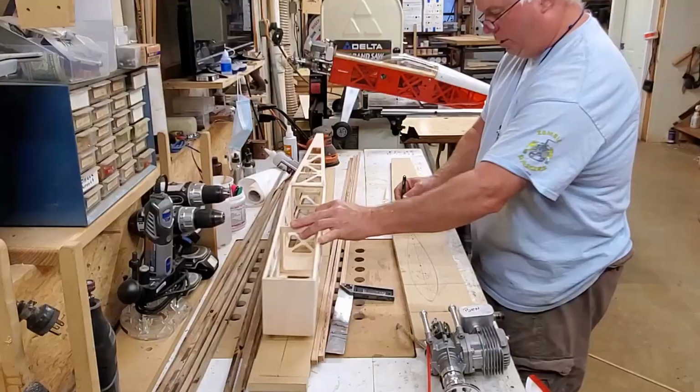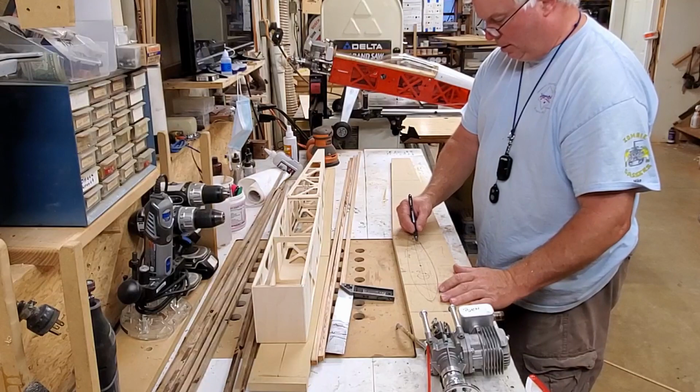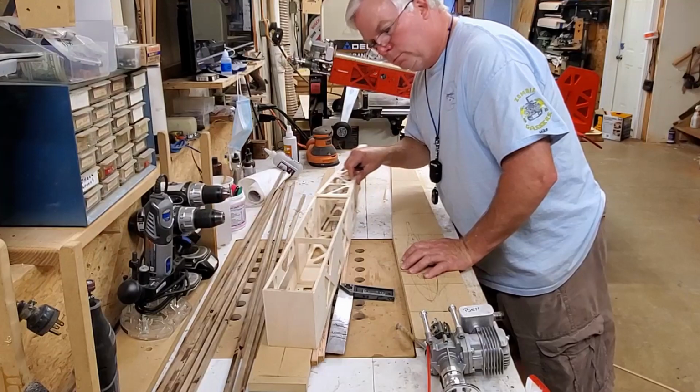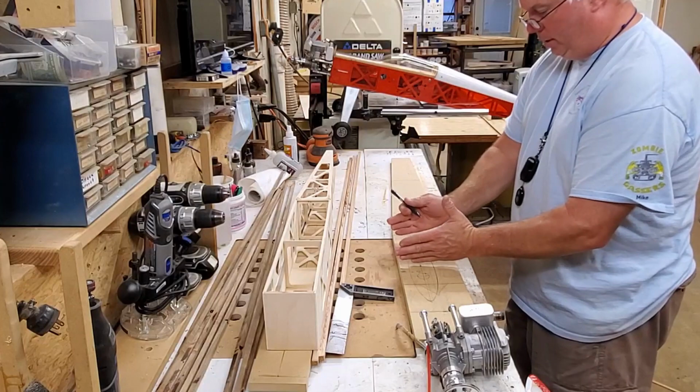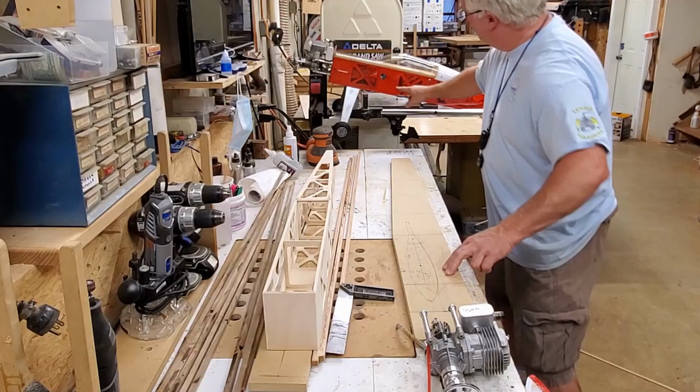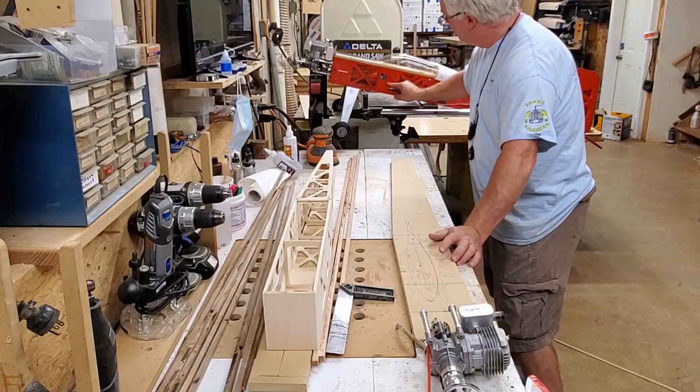And if we come up about 1.25 inches to get a good distance from that, we can move that anti-rotation pin wherever we want. So I had a pencil sitting right here somewhere. Anyway, we can just rough draw where we want to avoid putting lightning holes there and here. So anywhere in this area right here is fair game. And underneath the wing tube, we have a taller area here, so we can even take some weight out right there.